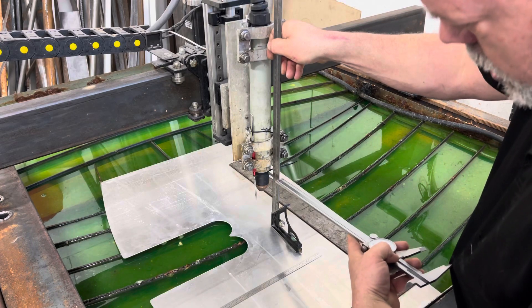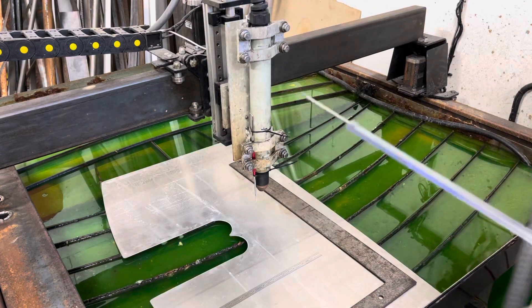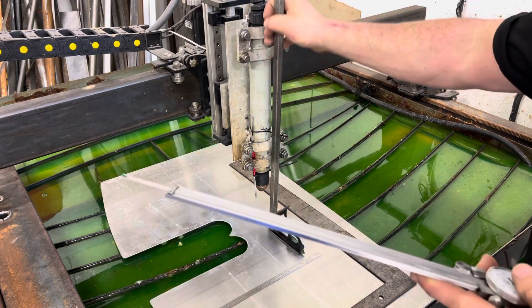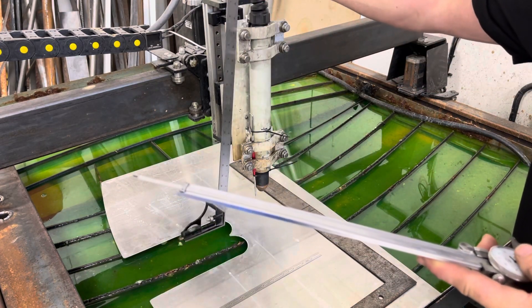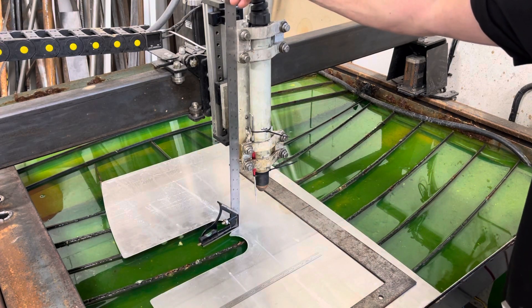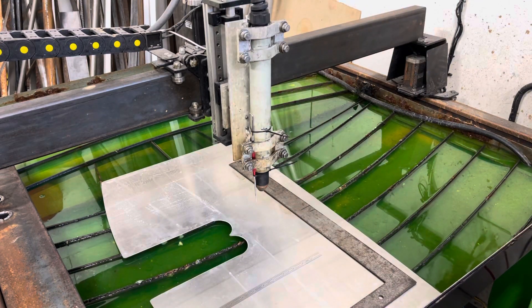Do the same on the bottom — those measurements need to agree. You need to do this on two planes: on this plane, and then perpendicular — 90 degrees off axis from that. Make sure they agree in both orientations. If they don't, you need to figure out a way to adjust.